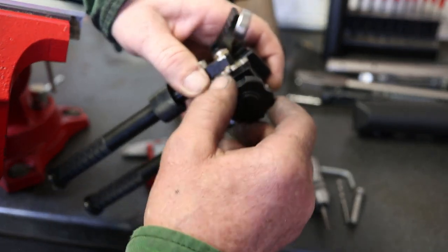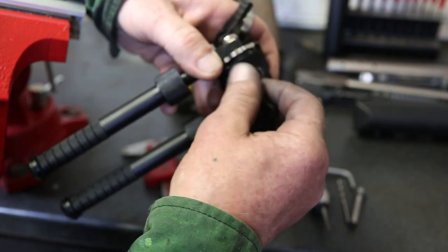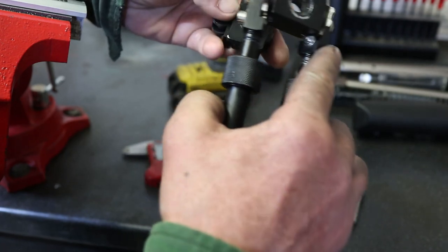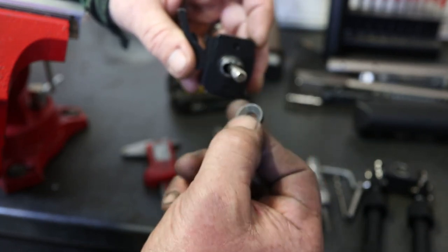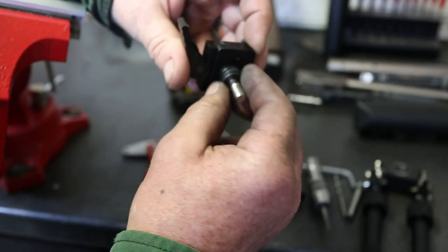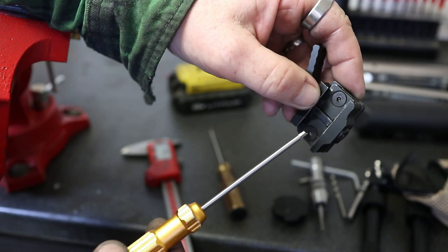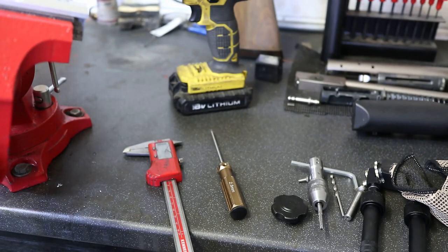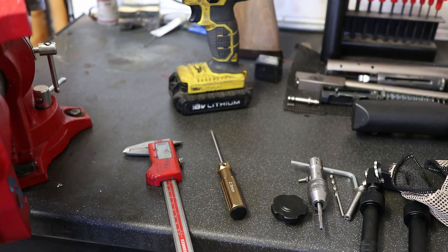So what you're going to do after you fix the vise is you're going to get this nut and take it off, and inside there is a spring. I'm going to get that spring and throw it away. Underneath that you've got a concave washer that sits on a convex one and allows all that ridiculous movement. Now we're going to take the 3mm Allen driver, and I'm going to fix my vise. I'm going to plop it in the vise and then put the camera back on it.